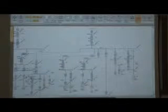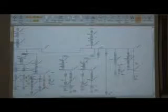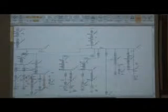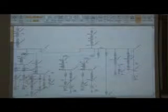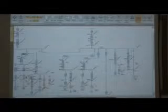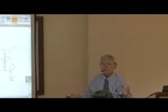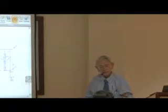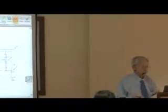You decided which breaker you wanted to open, what switching you wanted to do, how you wanted to do it, who you wanted to do it, how you're going to test actually during the operation to make sure that your decisions were correct. They may have seemed correct, they may not be correct, but you be very suspicious about the system and about your work. And then at the end, you took off all the grounds to be energized, and everyone's happy the job is done.